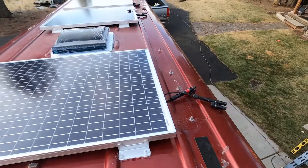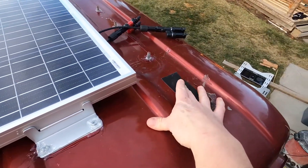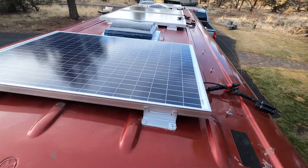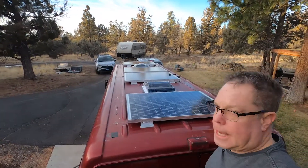I've got to wire everything up. I've got all the wires running on this side of the van right here — you can see all of them sticking out. There are holes underneath this piece of tape, so the wires are going to go right in there. I've got to get some caps to cap the rest of that off. Next up, I'm going to put my board together where I'll have all of my charge controllers, my DC to DC, my inverter — everything on one board. We're going to have all of our fuses, and that's going to go on the backside in the garage area.